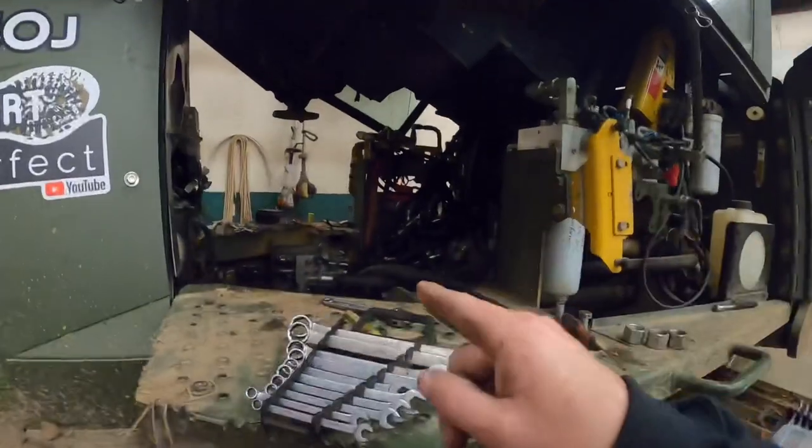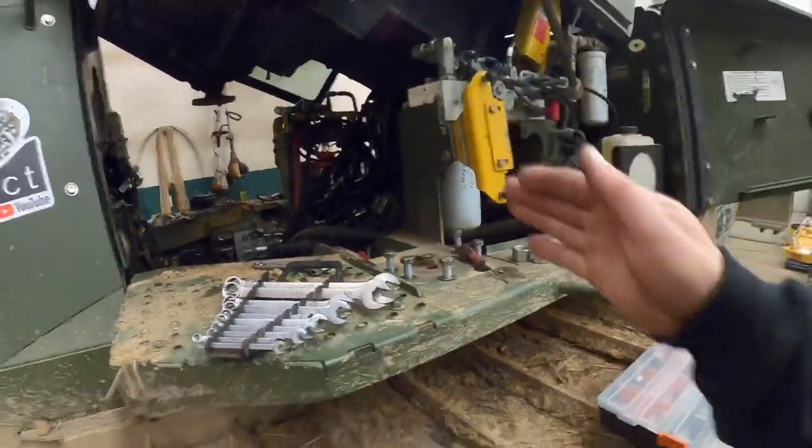That's perfect. All right, guys, unfortunately that's where we're gonna have to wrap up this particular video, but man, we made some huge strides forward in this particular project, and it's awesome. I'm so excited about it. The first big win we had was actually being able to repurpose the solenoid valve to a different spool to control the ripper, so that was pretty cool to be able to reuse some of the old stuff and make that work.